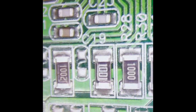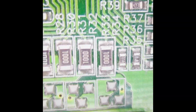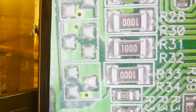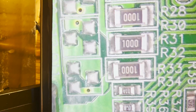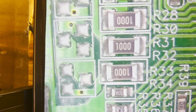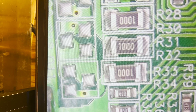Here is the board under the microscope. The resistors that are most likely broken are R32, R33, and R34. R32 is supposed to be 100 ohms, R33 100 ohms, and R34 one kilo ohm. We are going to check the values of those three resistors.